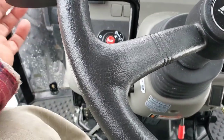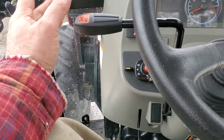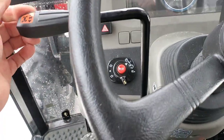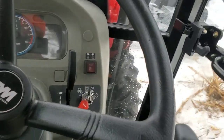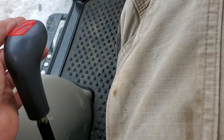This shift lever is the standard shift model. The shuttle is synchronized but not powered, and you have to be careful with it because you've got to make sure it's all the way engaged — it's a little bit tricky, that's something I don't like. Don't get into the habit of grabbing it at the base; grab it out here for a firmer feel. Dual brakes are fine, parking brake lever works good, hand throttle is excellent. The Deutz engine is unbelievable. Joystick control for the loader is right there with an auxiliary button; you can pre-select the transmission — four speeds there, low/medium/high on this stick.